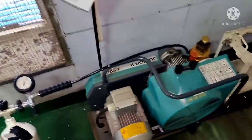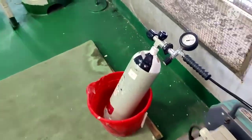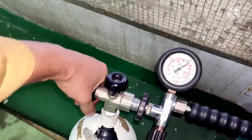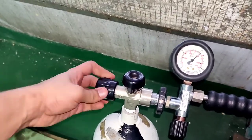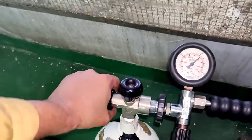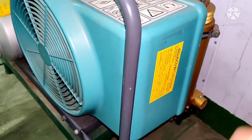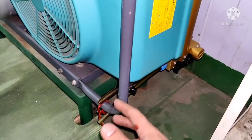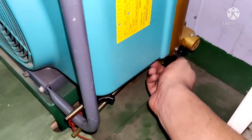The pressure is at 210 and we have switched off the SCBA compressor. The first thing you need to do is close this valve so the pressure doesn't escape — the air should be preserved. The second step is to clear out any condensed water inside the system, because pressurized air causes water to condense as explained earlier. We do this by using the relief valves.